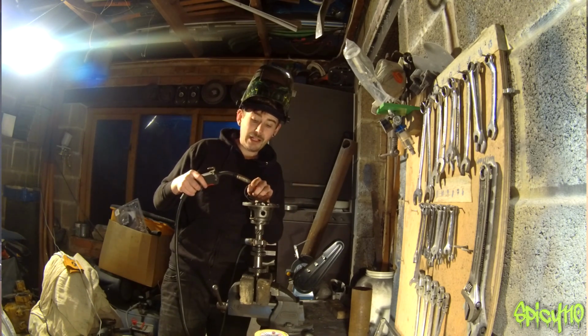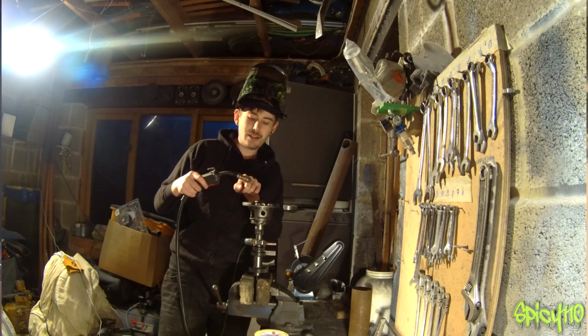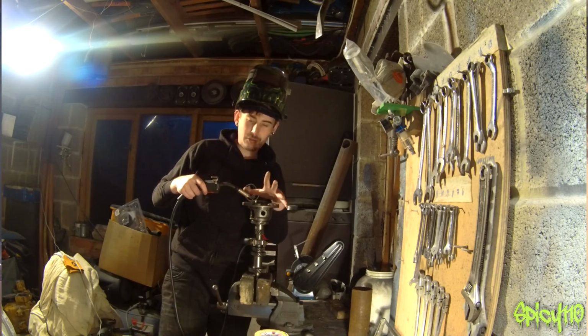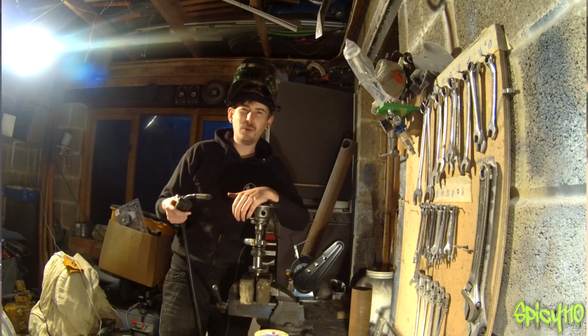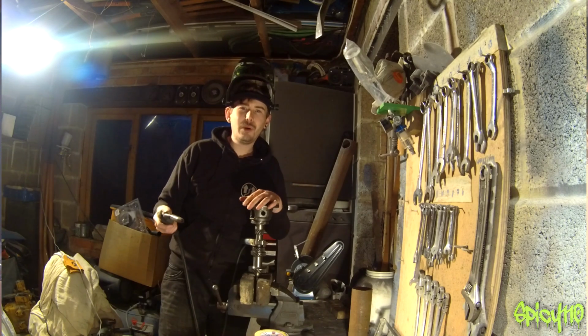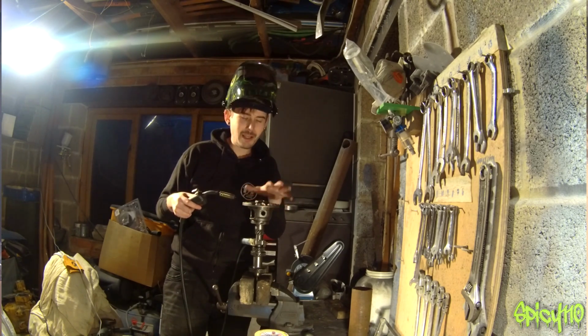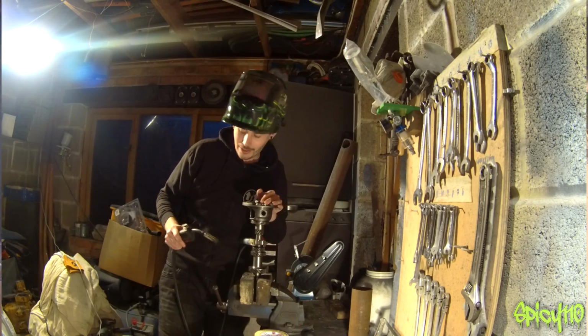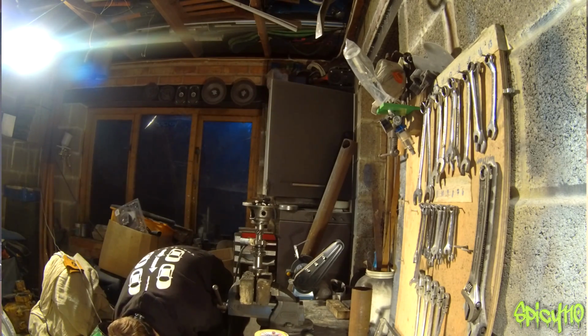And the only other thing really to it is that I've got a carbon dioxide and argon mix coming out of here, which will surround the weld, which stops it combusting. I think it gives you a cleaner weld, you don't get so many contaminants and you don't get some other weird things that happen. It makes for a much better weld. Anyway, enough flapping. I want it on 6.